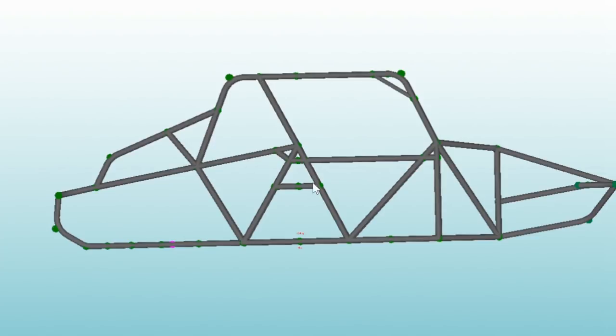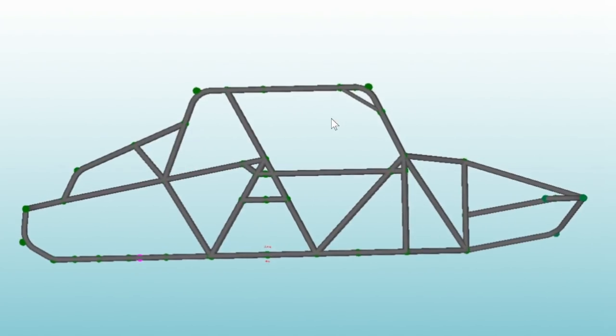Just for aesthetics — which I think is kind of cool — this main roll bar is leaned back at the same angle as my seats. So when the seats are in, they should follow the contour of the roll bar, meaning as I'm driving I'll be able to see out the side without the roll bar in my way. On my current chassis I made the roll bar straight up and down directly over my head, which is great for protection but leaves very little headroom.